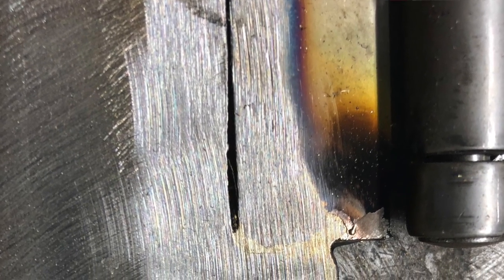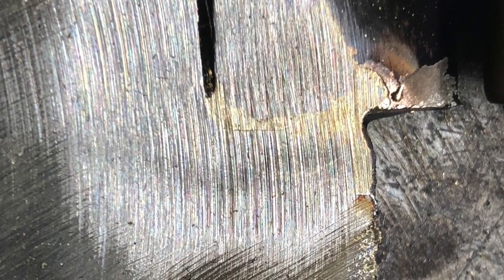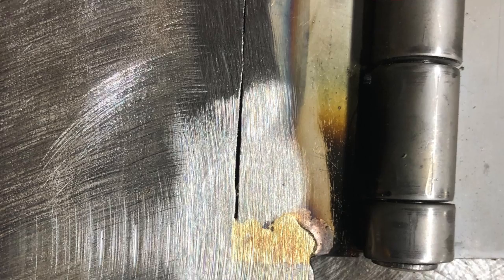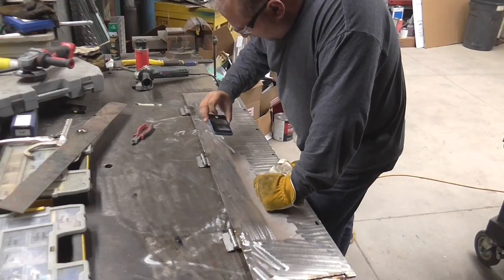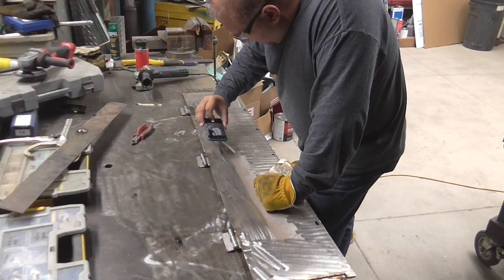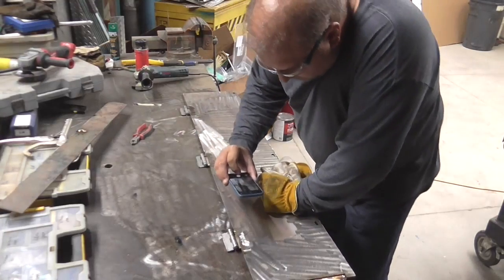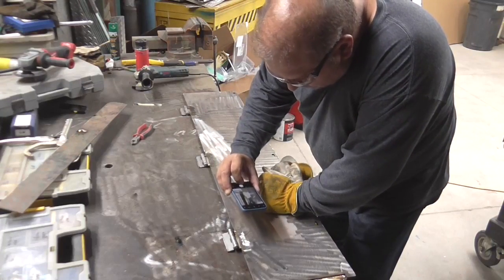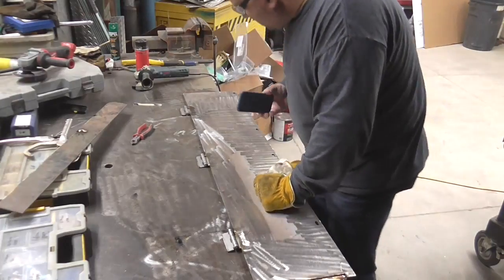I'm not really worried about the big gap on the long run, but these short pieces right here — those are the more likely parts where if there was a failure the hinge would break out. It breaks out on the short pieces first, not on the long piece. So I filled those in then ground them off just to be sure they will hold. And in case you ever wondered where the pictures come from, that's where they come from. Thanks for watching and see you next time.